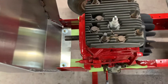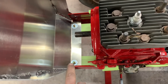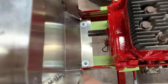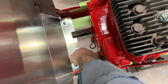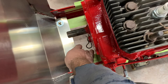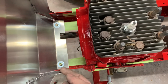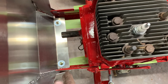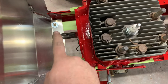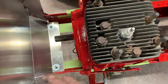This grill was another piece I couldn't find any pictures on for how it mounts. Basically it's got a cutout that goes around the frame. You probably could mount it below, but I chose to mount it on top. There were no holes in it, so I just held it up there square and straight, used fender washers on the top, and marked up through the stock holes that mounted the original one.